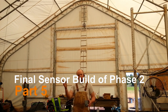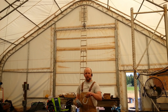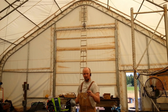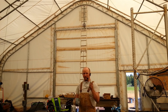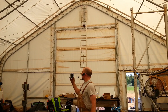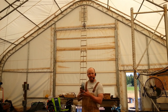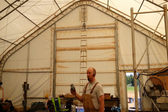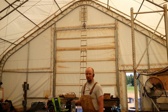I got the outside all dialed in — I even straightened it up a little bit with the level. What we have to do inside now is put a U-bracket along the pipe. There are three zip ties on it. We're going to put this on to really hold it in place. It's pretty snug right now, but we'll do this just to make sure. Then I have to mount this to the metal plate up there. This is going to hold the connections — everything that comes in here — it's a junction box. So back up the ladder I go and we'll get this done.